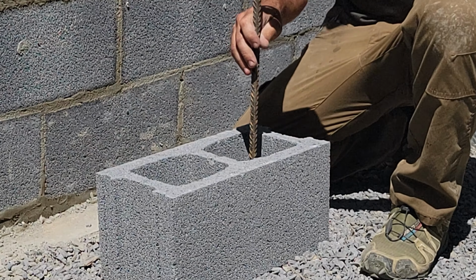What I do want to do is turn that pipe into the gravel bed here and have that pipe as low as possible, because this is where all the water will come that potentially gets into the foundation. It'll hit the gravel bed. The compacted soil below the gravel bed is pitched that direction, so everything will head this direction, but having the drain pipe lower will help ensure that the water is evacuated.